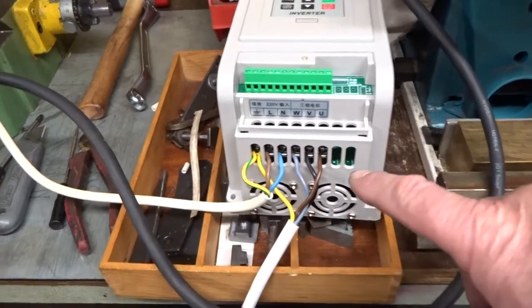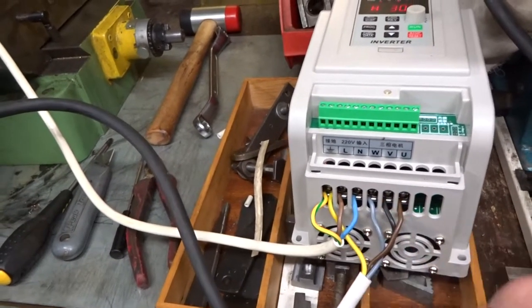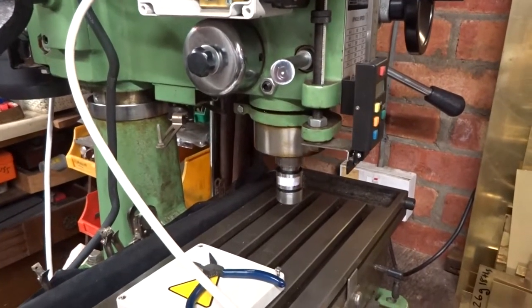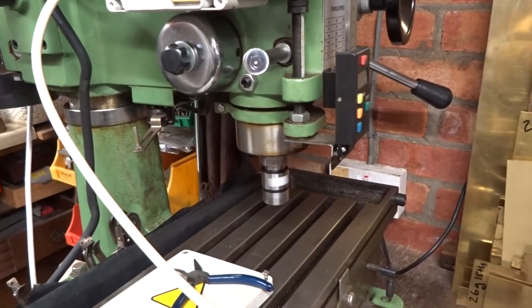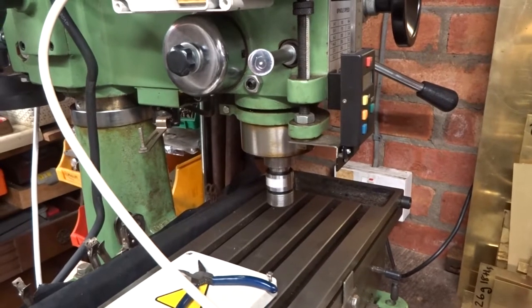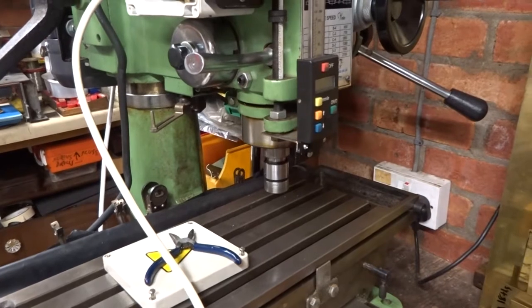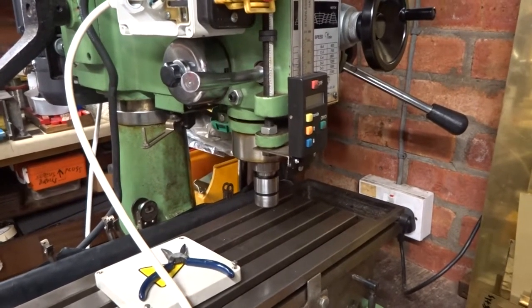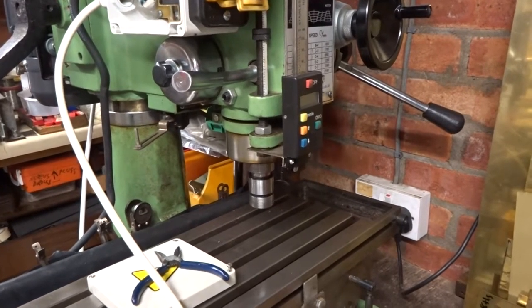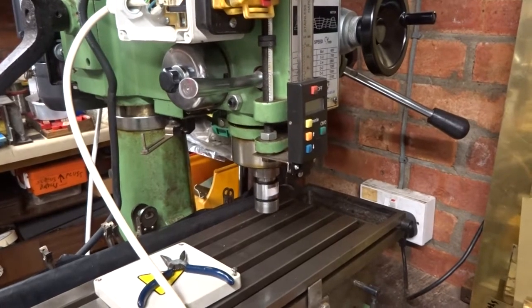Woohoo! I changed the U and the W wires around, switched their positions, and by magic that has reversed the direction of the motor, and the milling spindle is now running in the correct direction so that the collets etc. will be self-tightening and not come unscrewed, and everything will fly everywhere. Really happy